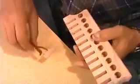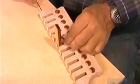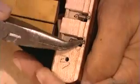Using a hot iron, the accordion maker seals the reed frames with beeswax. This prevents air from escaping. Now back to the keyboard. The accordion maker installs 10 valves made of maple wood. Each one has a plastic rocker on the end. A spring ensures the rocker has just the right tension to open and close the valve properly when the musician presses the button.